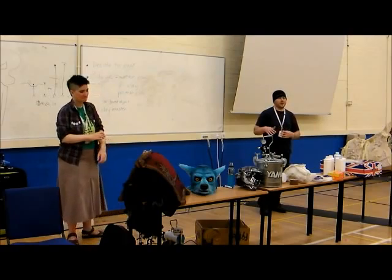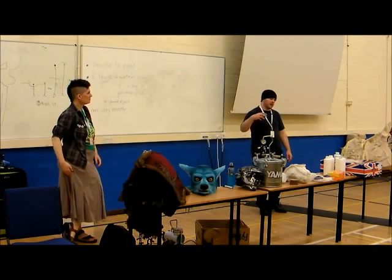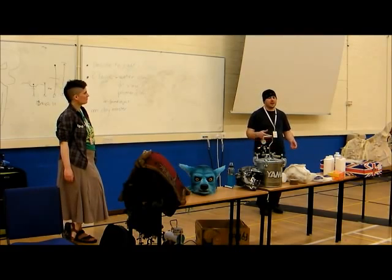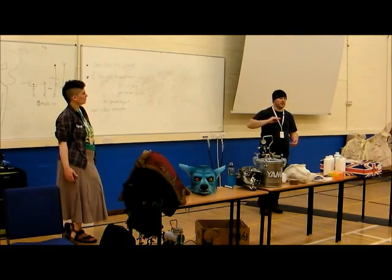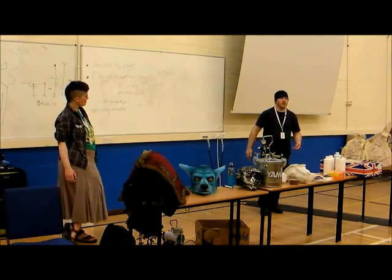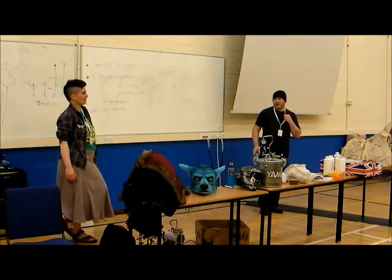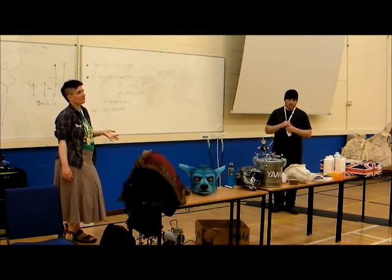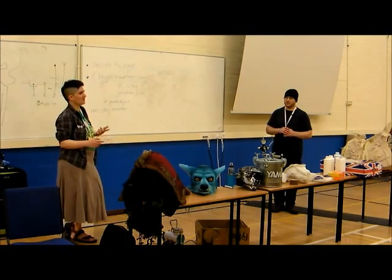You can microwave it, as long as it isn't something like Chavant Beau Touche, which has actually got a glue in it. If it's the other versions of Chavant or something like Monster Clay, you can take a blowtorch to the surface and be very quick and melt the surface into a high gloss. With a heat gun you don't get quite as good an effect because you're not melting. So oil clays, they never dry out. It's a great advantage. They're reusable, so you can salvage 90% of it from your mould.